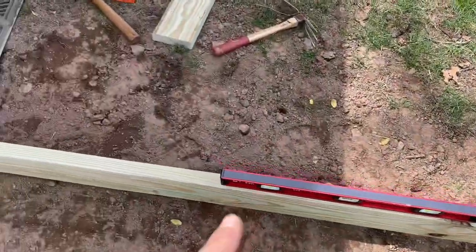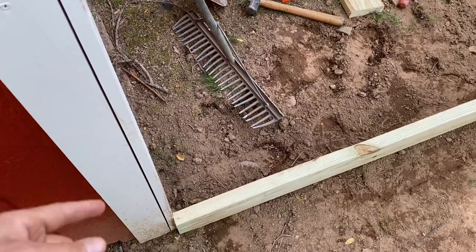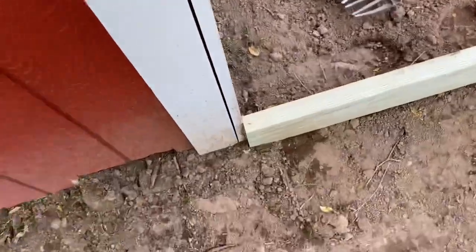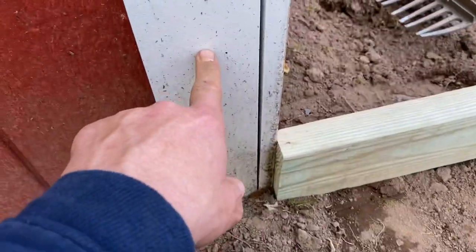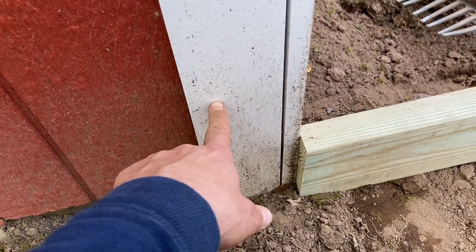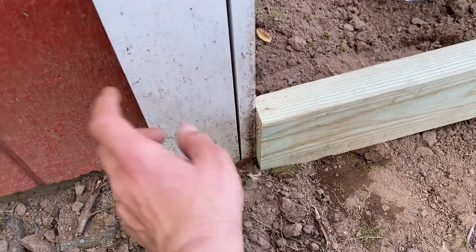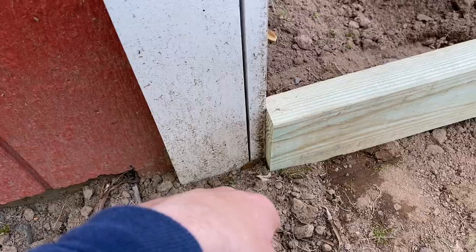And then if I come over here, I need to level this off, but I can't do the mount because I need to get a plate to put in here. So I've got to do the same thing I've done to the other ones and just get a bracket plate so that I can mount this board through. And I'm actually going to use the bigger ones, the 2.5s instead of the 1-inch screws, because I'm not going hardwood to hardwood. This is just trim pieces. So I'm going to be able to go right through the trim piece, and I'm going to use a 2-inch flat strap. So I'll catch it here and right here, and I'll flat strap it right in. And that way I'll be able to get right into the stud on the inside of the shed with a 2.5 right in. Done. Everybody's happy. It sits where it needs to. So that's where we're at.